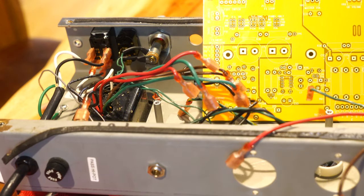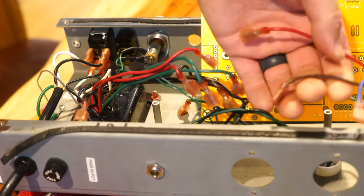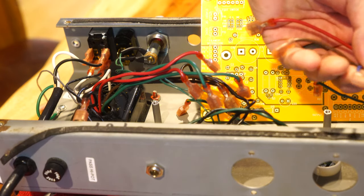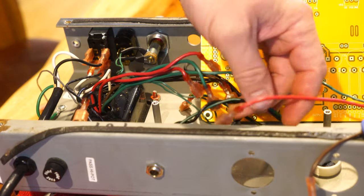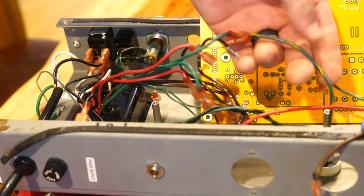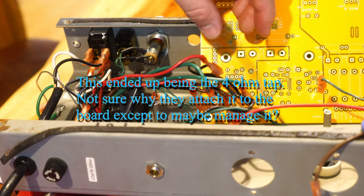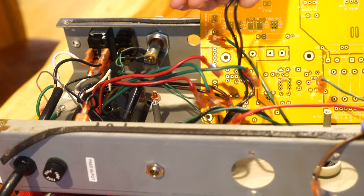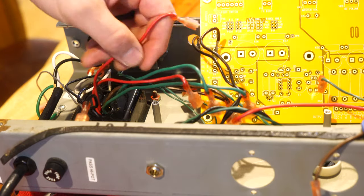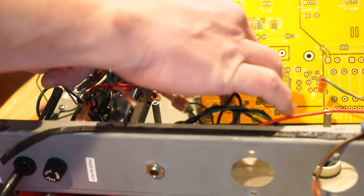For the wires — these are obviously the output transformer, so red is the one that goes to high voltage, and brown and blue are my two output transformer leads on the other side. These hook up to this jack right here. There's a green and black, although there was another one — a green with a yellow stripe that went to the board — I'm not sure what that comes from. That could have been part of the negative feedback. I have two black wires at the choke, two green wires for my heaters, and two red wires for my high voltage.